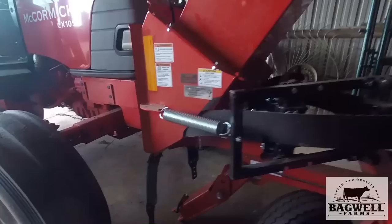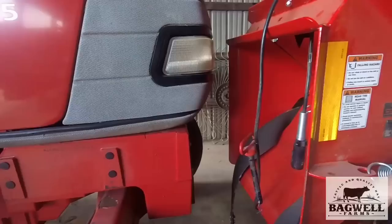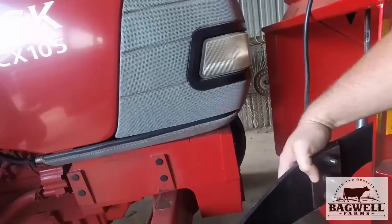It pins into it, then you have your guide belts for when you're turning. These belts keep the hay from popping out as you turn, so they line it up to go in there. They have these belts that run out the side between the baler and the accumulator.